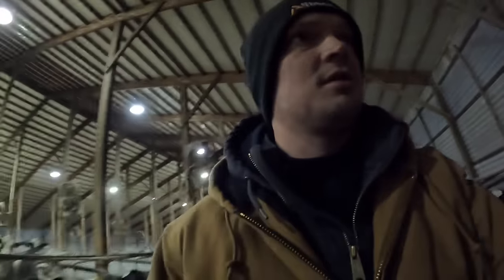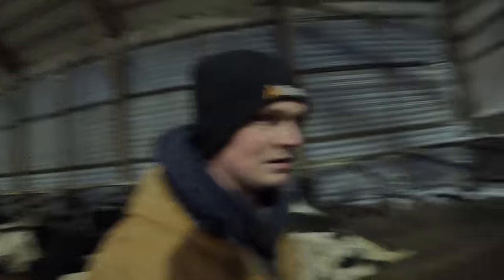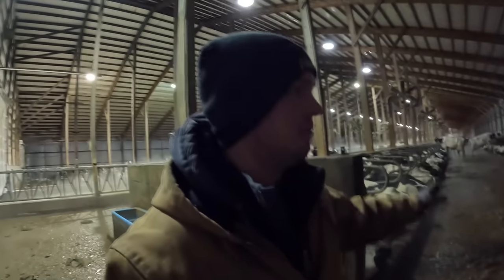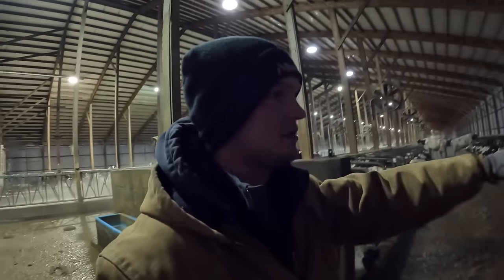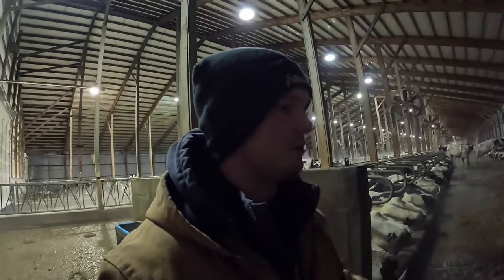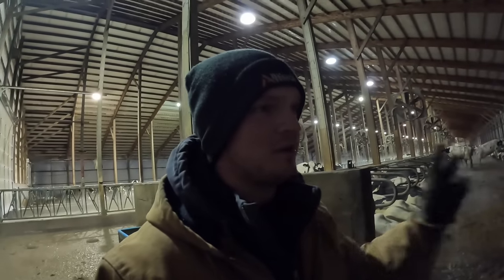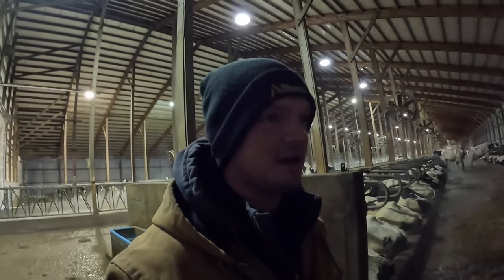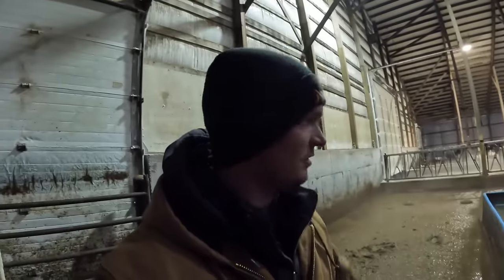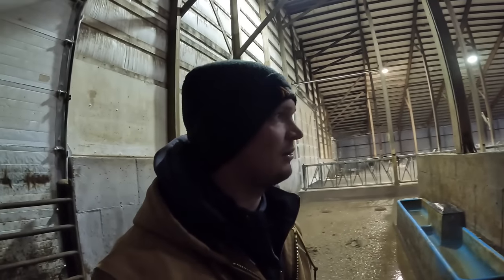But at the end of the barn here, it was leaking further back, so I'm not sure if it is going to the water trough. So there's a water trough at the end of the barn, another one on the end of that pen. The way that most of these barns are plumbed is the main line runs outside the barn, and then there's a water pipe hose, I don't know what the actual term is of those pipes, but they connect to that 2-inch, and each water trough has an individual one. So the idea is that there's no couplings under the barn, because that hose goes right from that pipe up in the riser underneath the water trough to the valve in the water trough, so that we have less chance of having a water leak right underneath the barn.